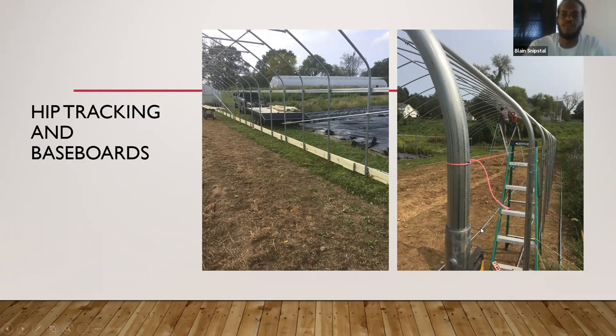Usually we just pull 4 or 5 inches up from the top of our ground post at one corner, and then the other corner down the length, and then run our string line. And then we pull 7.5 inches up from the ground on one corner, make a mark, and then find the distance between that 7.5-inch mark and that mark that's up on the hoop. And usually that gives us somewhere around 54 inches. And then we just copy that down there at the end of the tunnel.